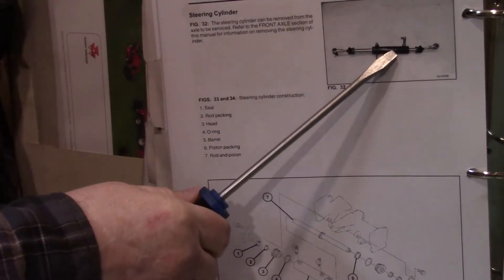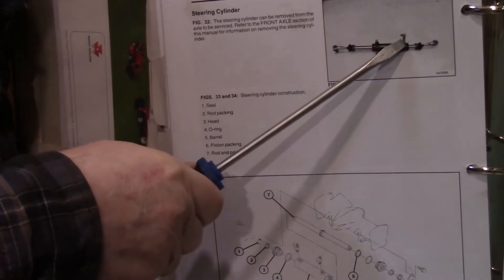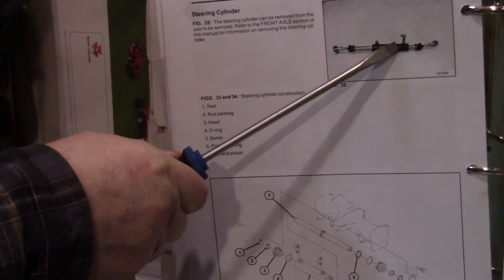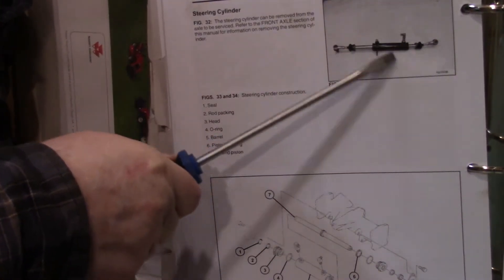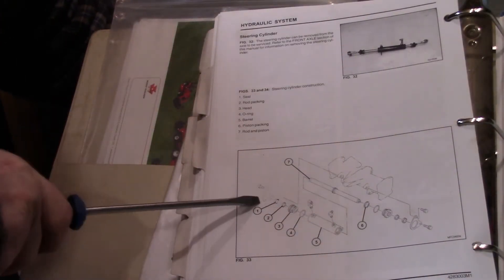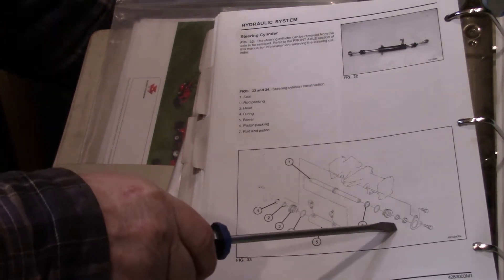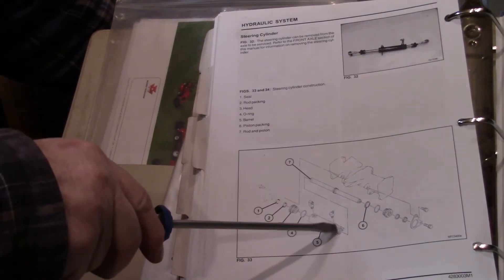That's what the actual steering cylinder looks like. It's a double-acting cylinder — it pushes and pulls on both ends, and there are two hydraulic line fittings on it. My concern is that the cylinder is getting loose in the two flanges that hold it in place, and I'm afraid it's going to start moving around, maybe cause some problems with those connections or hydraulic leaks. The part I'm interested in is these flanges — two bolts hold each one in place, and together they secure the cylinder and keep it from moving.